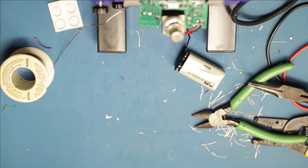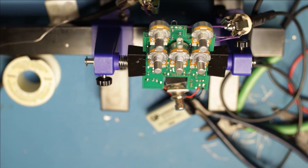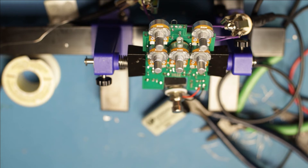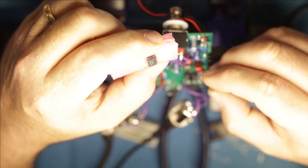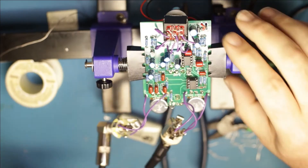We need something plugged in - let's put a little jumper in where the power port goes. The chips aren't in yet. True bypass - the bypass works. The 558 goes here, the 072P goes here - one goes towards the notch side. There's a little detent on the chip.